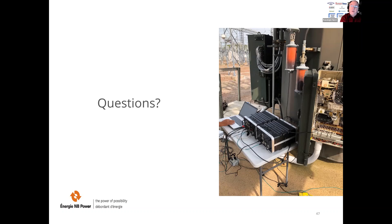Regarding the frequency bandwidth of vibro-acoustic sensors: it's around 15 kilohertz. Are they the same as acoustic emission sensors? No, it's a different sensor — a piezoelectric accelerometer following IEC standards. The accelerometer operates below 100 kilohertz, whereas most piezoelectric acoustic emission sensors are designed to operate from 100 kilohertz up to a few megahertz.